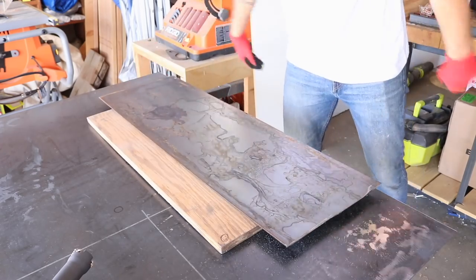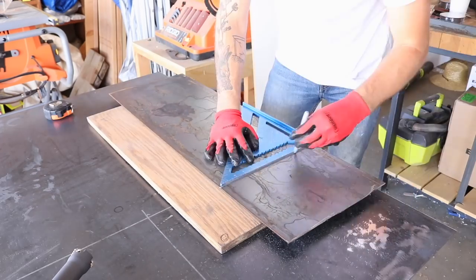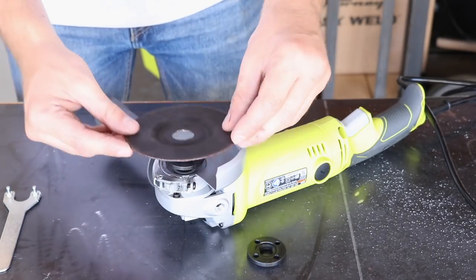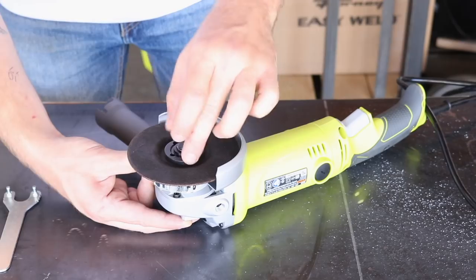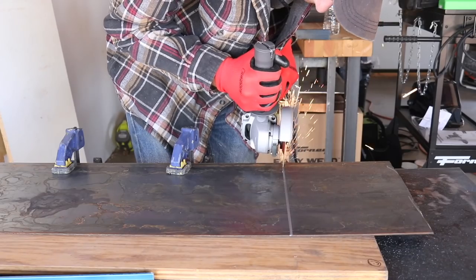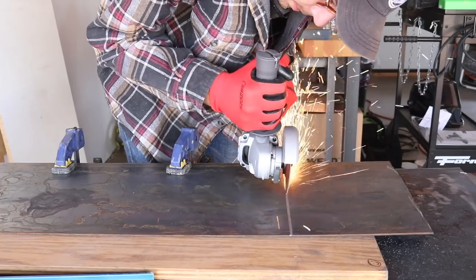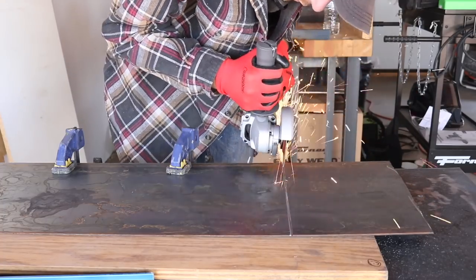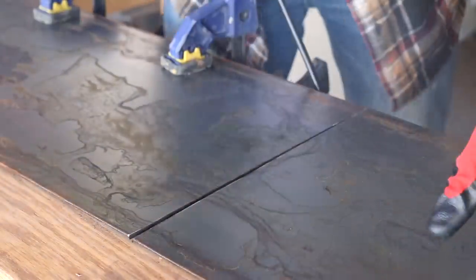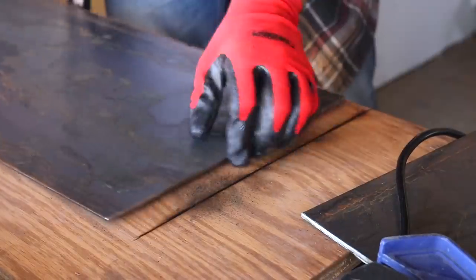All the metal used in this project is 1/8 inch plate steel and I had some left over from a previous project. Plate steel is awesome because you can get surprisingly straight, clean cuts using a cutoff wheel on an angle grinder. After measuring to the proper length, I cut it following the line. The trick to getting a good straight cut is to do it in passes — the first one is just to establish your line and make a groove, and then from there you'll go back and forth until you cut all the way through your piece.